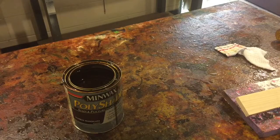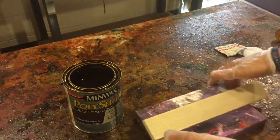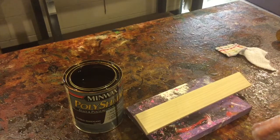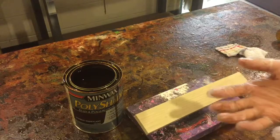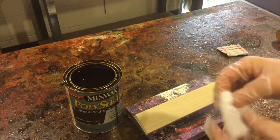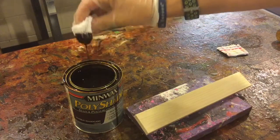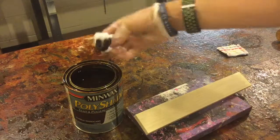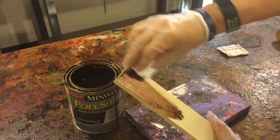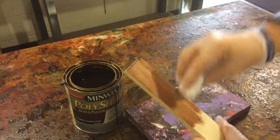Now that our stain is all mixed together, the next step is putting the clear coat and stain mixture on our board. Notice the board is on top of the nail board — suspended, not directly on the table — and we're going to coat all the sides. Put on your gloves to protect yourself from getting stain on your hands. Take one of the square rags, make it into a small bunch, fold it up, dip the tip into the stain, and wipe off any extra on the edge. Then wipe the stain all over the board. Don't worry about areas with too much stain right now — we're going to let it set and soak in a little bit.